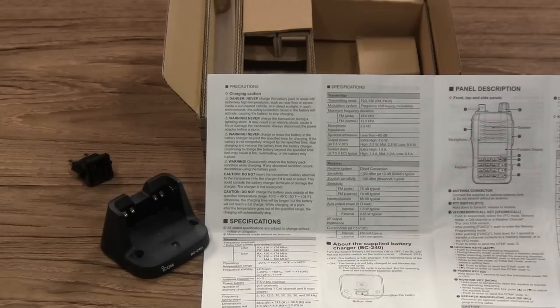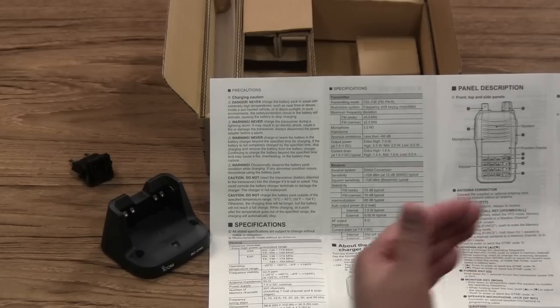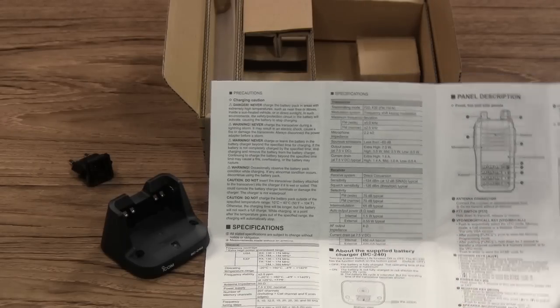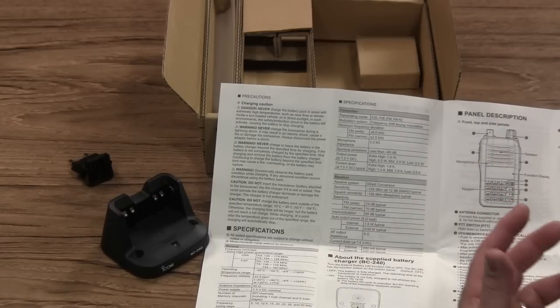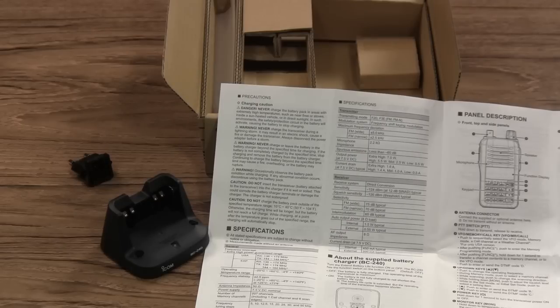Interesting. I don't know that I've seen that on a handy-talkie before. Usually you have an IF frequency. Right. And that IF frequency is where you can get mixing of signals and image rejection issues and things like that. That's something interesting to see when the ARRL does a review on it.